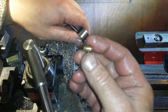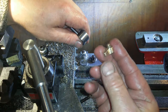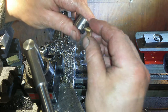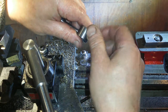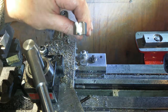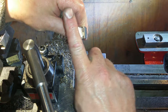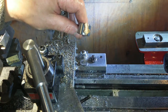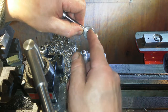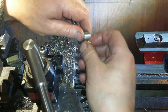So it's solid brass. And I turned it out of a piece of 16mm stock, and then milled it, and then filed it. That's all good. I timed it so it's not quite to the top, so when it wears, the idea was it's got plenty of room to wear around to the side. But I did put slideway oil inside it. Might want to change the oil I've put inside it.